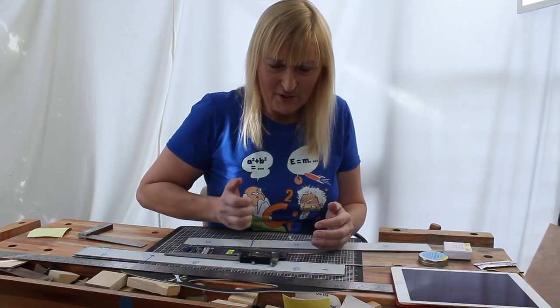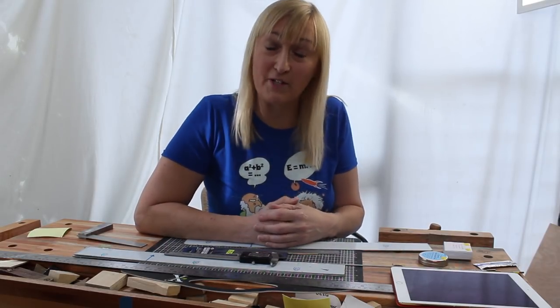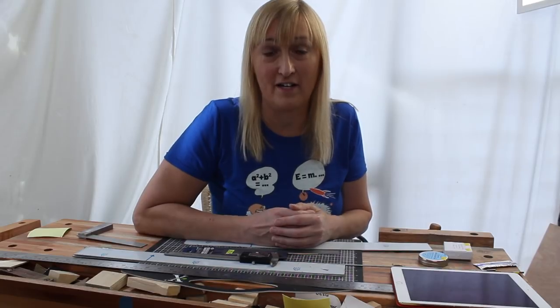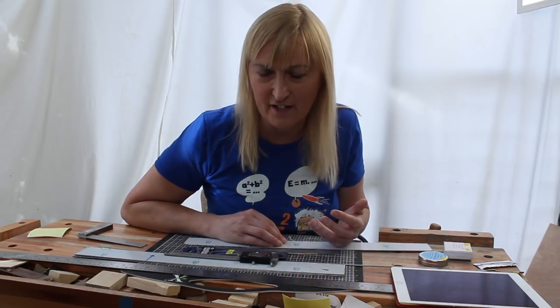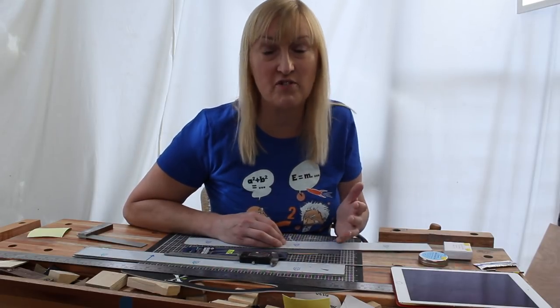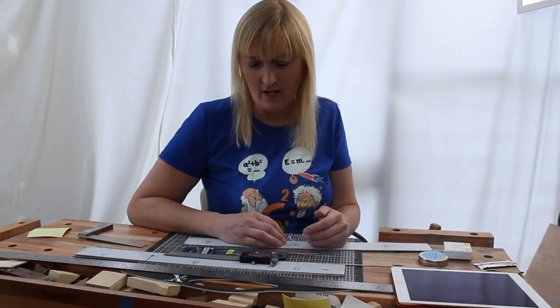Where do we position the frets? Well, the way we do that is we go on the web, we go to a fret position calculator and we read off the frets according to our scale length. The scale length I'm using here, by the way, is, let's call it the Martin small body scale length. It's 24.9 inches, but in millimetres, I think that is 632.4. That's the scale length we're aiming for here.